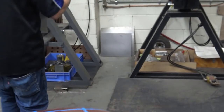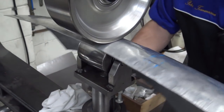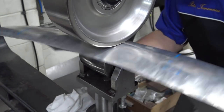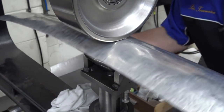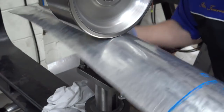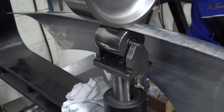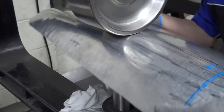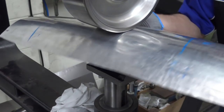Back on the wheel. And just simply, no pressure, wheel that in. Don't squeeze. If you squeeze here now, you're gonna put a lump. Then you have to put a lump here, then you have to put a lump there. It doesn't work that way. Just smooth it off. Just concentrate on that and smooth it off. Okay, I got a little bit past it so I can blend it into the next one. There we go.